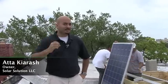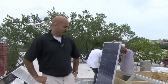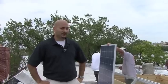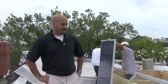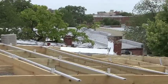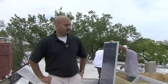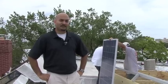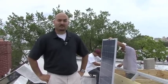Can you give me an idea of what goes into building this, from framing on? What's going on in the roof? Well, what we've got here is a non-penetrating system that more or less sits on the two party walls. That way it reinforces the roof rather than putting additional pressure on it. With a lot of the homes we have in D.C., customers prefer that — it's non-penetrating, so they never have to worry about any type of leaks down the road.